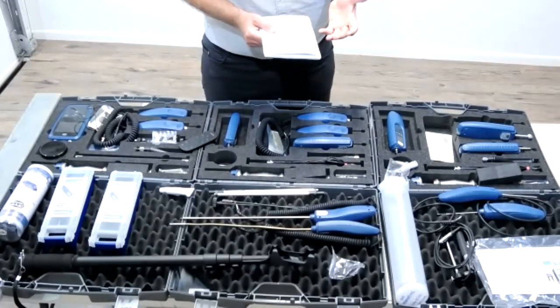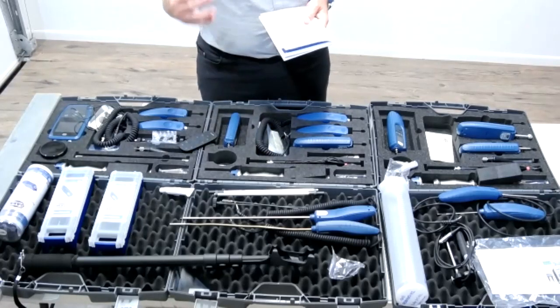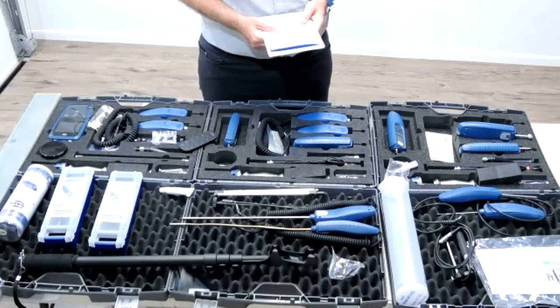So on a relative scale, you can go to an unaffected area and get a reading. And how deep do we go? How deep? That always depends on the density of the material. The effective measuring depth is probably, say, 4 to 5 centimeters in very dense materials. That's the effective, as I call it, measuring depth. But you will always have to be careful, because moisture on the surface will always dominate the reading. Exactly. So if you have a wet surface, you will always get a very high reading, no matter if the rest of the material is absolutely dry.